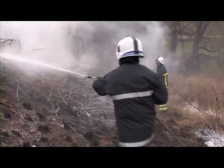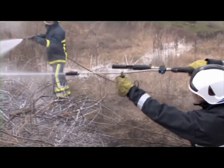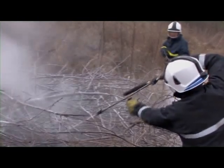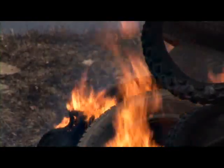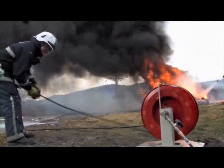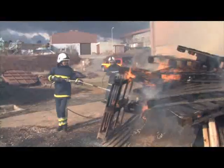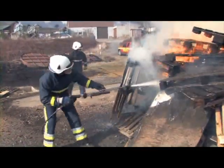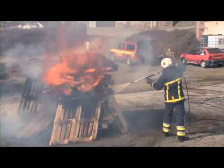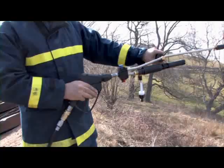The FAS Ultra can be operated on single or twin hose reels. It is the only high-pressure, rapid intervention system that offers the possibility of simultaneous dual application. Each fixed 30-meter hose length has a removable lance. The standard lance offers twin nozzles specifically designed to enable the operator to attack various fire types in a multitude of ways. High-pressure jet or spray and low-pressure jet or spray, together with a low-pressure aspirated foam nozzle.